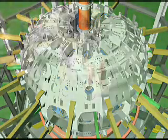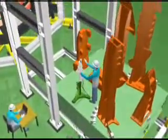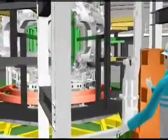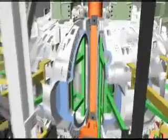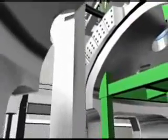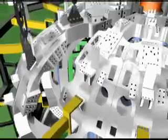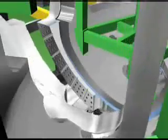The last TF magnet assembly is the most difficult process in the K-Star assembly. Therefore, the 22.5 degree gap for assembling the last TF magnet is accurately measured by an optical metrology system, such as a laser tracker. In this way, the thickness of the insulation plate for the attachment of the last TF magnet is determined. Then it is assembled by a very accurate straight line movement. This process can be repeated several times to make the accuracy meet the assembly tolerance.